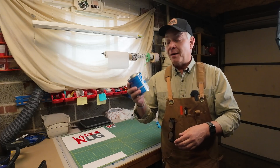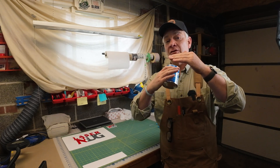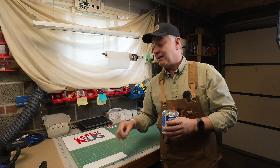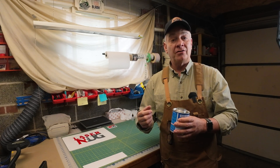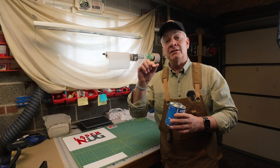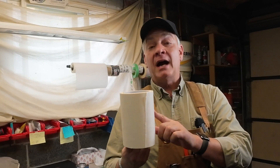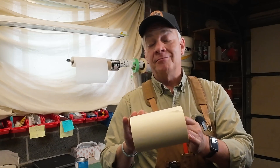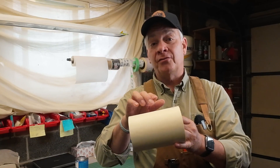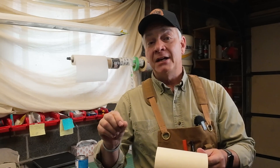So that was a learning. I believe the way this bonding agent works — and many others that are similar to it — is it, for lack of better words, melts the two pieces of acrylic together. And that's why I don't think I'm going to get those smears off the back of my sign. I'm going to talk to the supplier and see, because I know there's a couple of different cleaning agents for acrylic. But unfortunately, once it drips onto the acrylic it starts to do its job and it begins to melt it — so I don't think I'm getting that out. I had mentioned that perhaps it would have been better to leave the mask on the acrylic before bonding the pieces together. Off camera, I did test it, and it doesn't work — this bonding agent will seep through the masking tape and still begin to melt the acrylic. So that wouldn't have helped. I think it's more about trying to manage the flow out of the bottle and to make sure you do your best not to drip any on the acrylic.